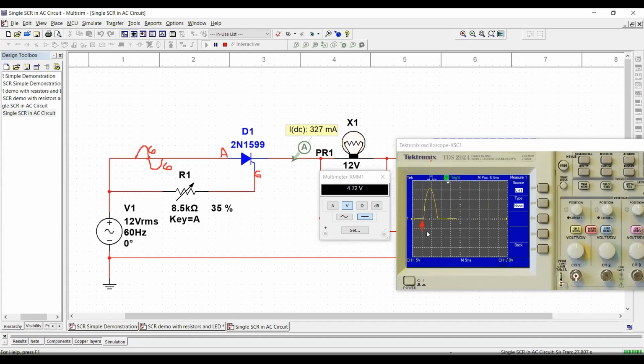So I want you to observe the following. I want you to see how the position has shifted. You see that I didn't touch the oscilloscope. However, the position of the sine wave, my rectified voltage, which is my pulsating voltage, has changed from the initial position and has shifted slightly, right? Also, you can notice how the output voltage has been reduced slightly. We have lost about 200 millivolts. Now, why is that happening? That is happening because by introducing a higher resistance through the gate, we are delaying the firing sequence, or the time when the SCR is supposed to start.